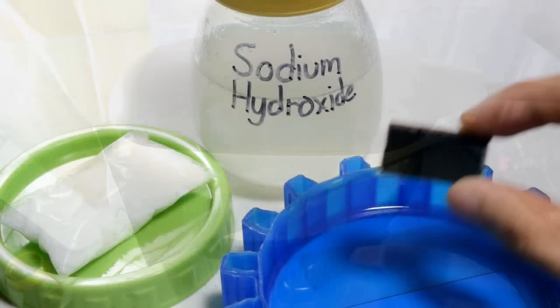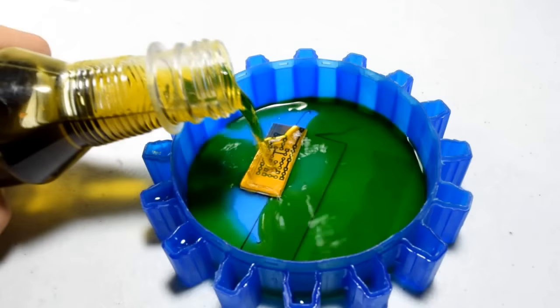It's now time to develop the PCB in a mixture of sodium hydroxide. The lines will show up after a period of time. Drain the container, then fill it with ferric chloride. Ferric chloride is used to etch copper. This could take 30 minutes, and agitating the tray should speed up the process.